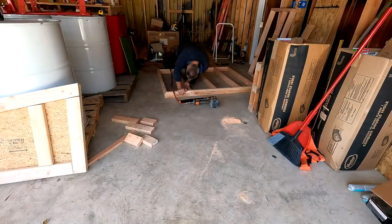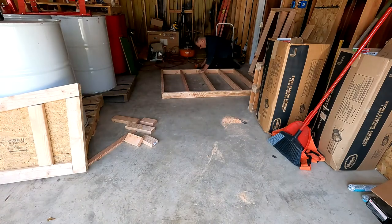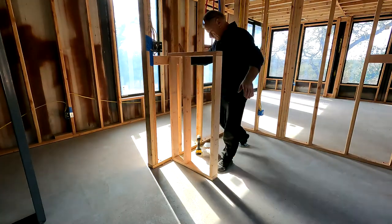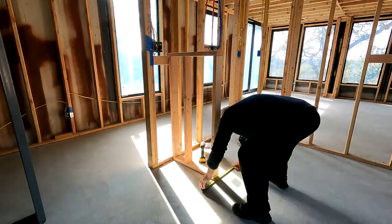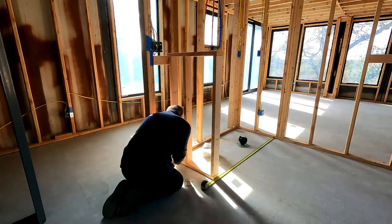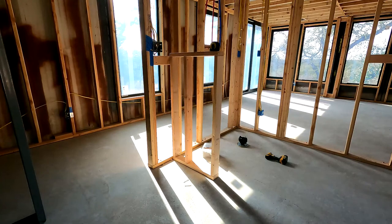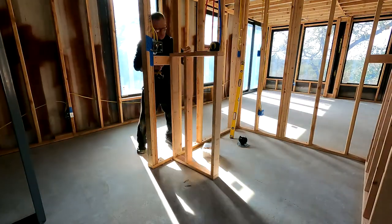The pony walls are normal two-by-four framing - square up the outside two-bys and then just nail the center points in place. All of them are the same height. I made them all 42 inches high so we can have kind of a shelf area to put stuff on. It kind of keeps the water sort of in check, but from our past experience with a freestanding walk-in shower it's not a big deal, so it should work pretty good.